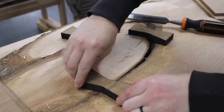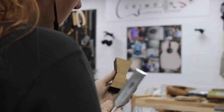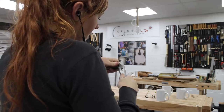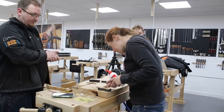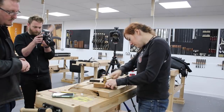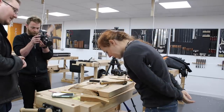Even though this made up an entire day's worth of work, I love it — I love having a guitar that pays homage to the woodworking side of it. Before inserting the bow ties into the body I quickly used a chisel to cut a small chamfer on the bottom edges of all the bow ties, which makes inserting them a little bit easier. I applied a good amount of wood glue to the bottom of the cavities as well as all of the side walls.